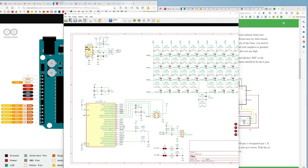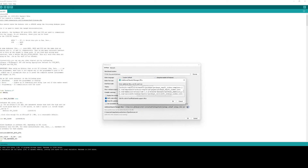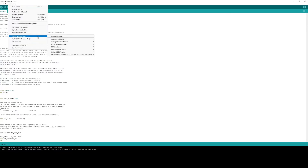Once the hardware is hooked up, you get to the programming. I think you can probably make it work with AVR dude natively from the command line, but I couldn't figure it out. So I hooked up the Uno and fired up the Arduino ISP software. I added a board manager — this package from Carlos EFR at mega master — which let me add the ATmega 328p. The board is Arduino Uno, port was COM5.